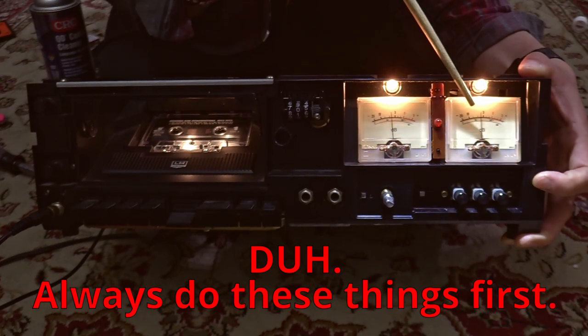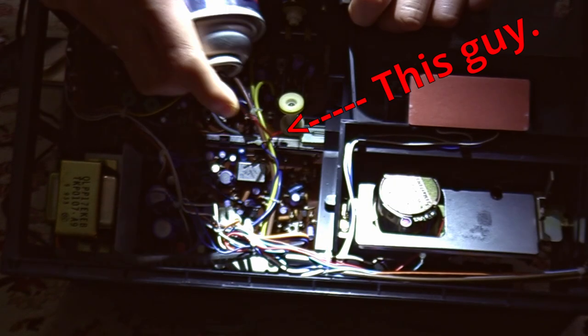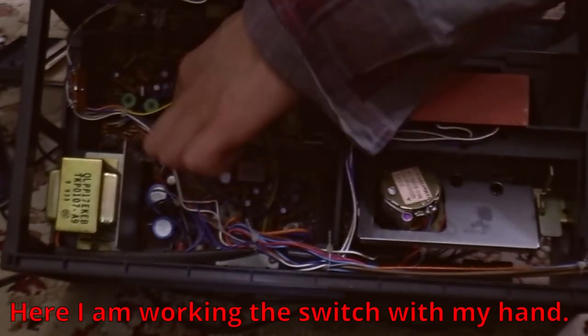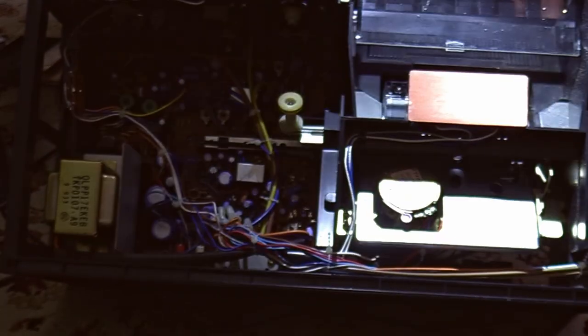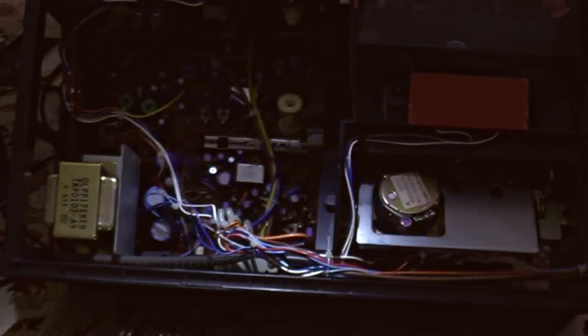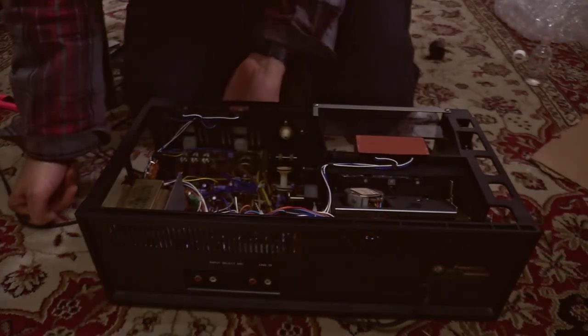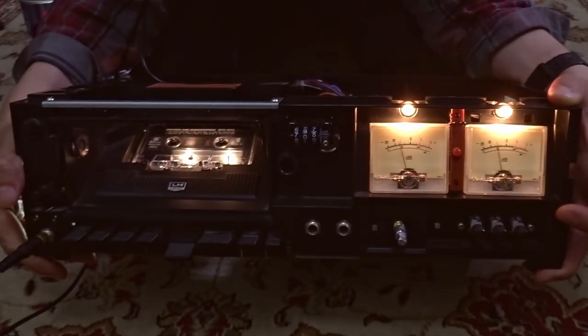That wound up fixing the issue immediately. In most cassette decks there's a sliding switch assembly that switches the circuit between recording and playback, and this is the third cassette deck I've repaired where that sliding switch was the culprit of why I wasn't getting sound. I must emphasize: before you do anything on any piece of electrical equipment, spray some contact cleaner on the switches and potentiometers. That's the bare basics — if I'd done that immediately I would have saved myself an hour.